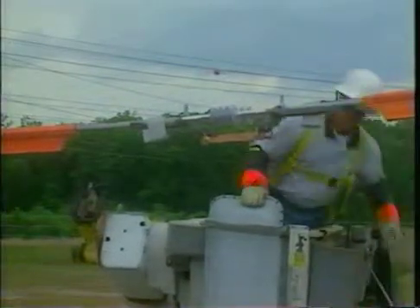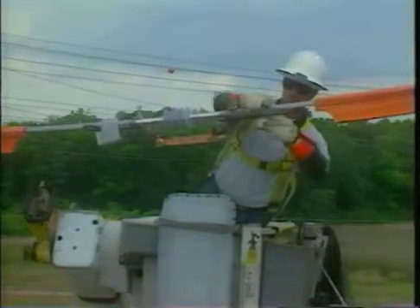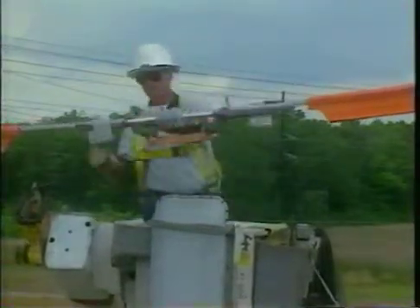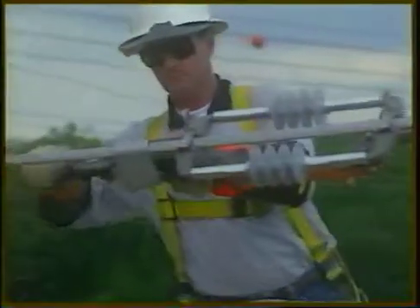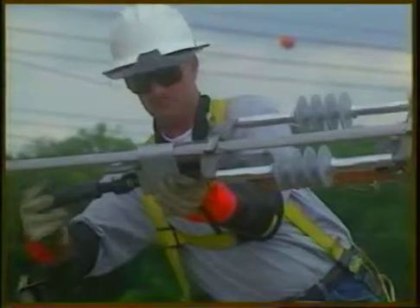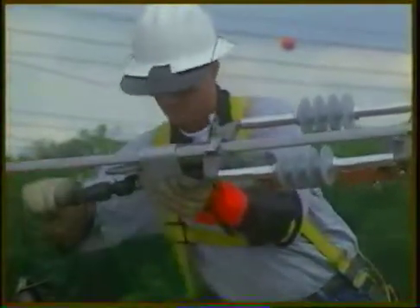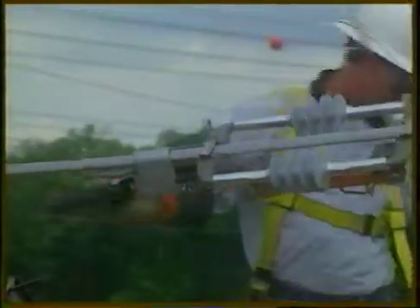The wide end of the C component must be adjacent to the pulling eye. The wedge is then inserted with the large groove against the dead-end yoke assembly. The yoke assembly provides both electrical and mechanical termination. The standard Ampact tool and the corresponding taps complete the effortless application.